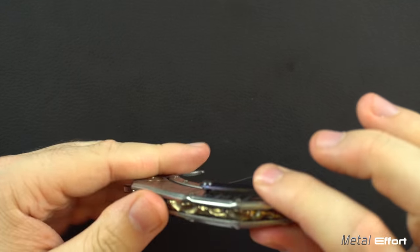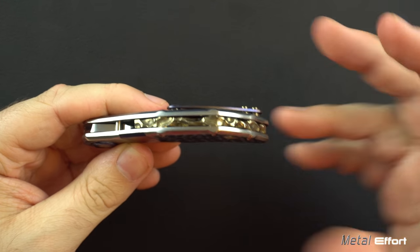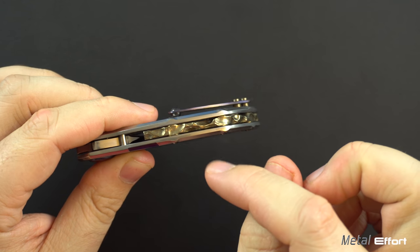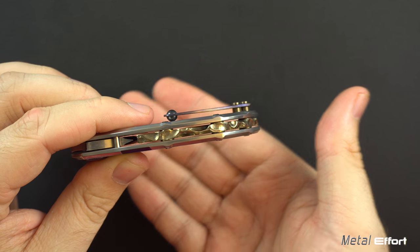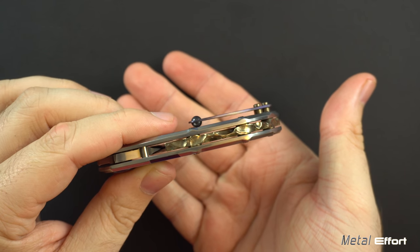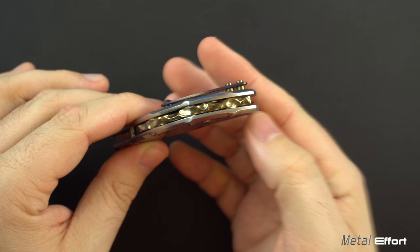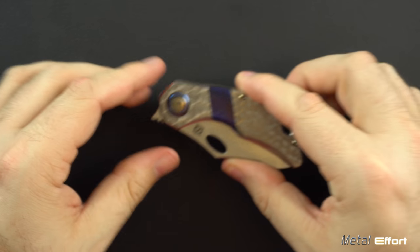The next thing I like is the backspacer. This isn't so much about the Golden Nugget backspacer, which I personally chose aesthetically, but it's a floating backspacer. It's got those little ridges so that it gives it that nice finished look without actually having to be press-fit, which is really difficult. They're not using CNC machines on these — these are handmade. This floating backspacer is the perfect solution: it looks great, gives it a very fine-tuned look, and gives you a little bit of wiggle room when making the knife.